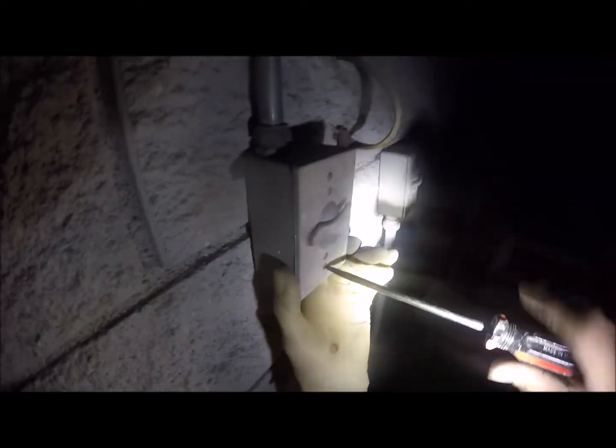Now, you can turn it off by hand. However, you probably want to shut the sub panels off first, and you want to reduce the power from the breaker, because it can arc. You can wind up with arcing, which is jumping electricity, and that's why you would do it with a broomstick. Oh, that thing's like 300-400 amps. Yeah, that's enough to flash fry a human being.